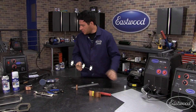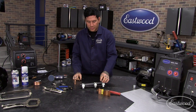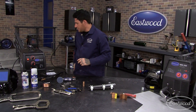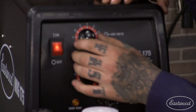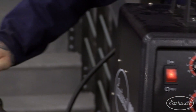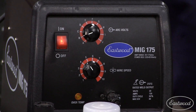I'm going to set up the machine here and we'll do a couple stitch welds on this and show you what it looks like after a couple of zaps. I wrote down all my settings ahead of time so we aren't fooling around with the machine. We'll make sure the gas is on — we're using a 75/25 argon CO2 blend, which is pretty standard.